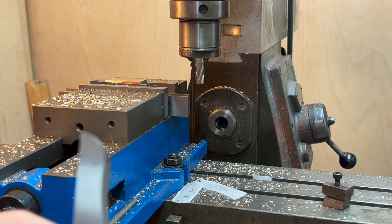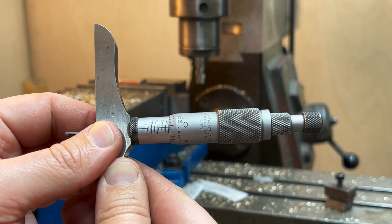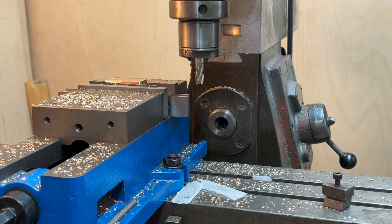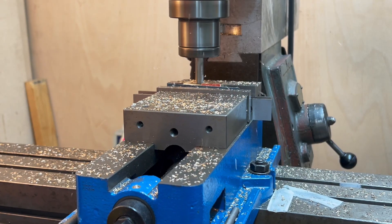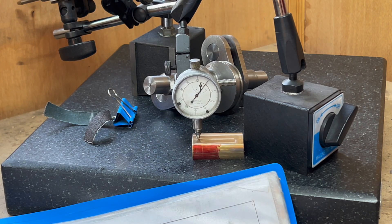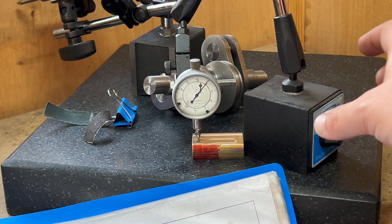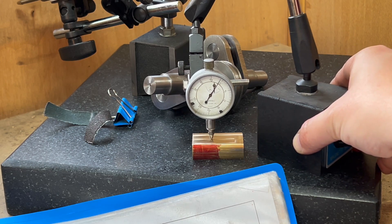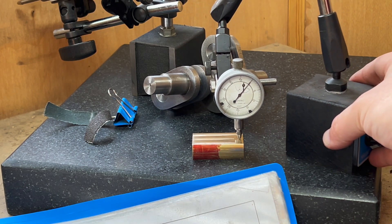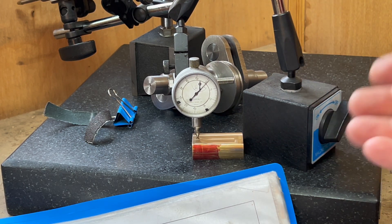If I use the depth micrometer — basically at 575. So 35 to come off. I was really a bit worried about the parallelism of the sides of this piece because it twisted in the vice that time. I thought I straightened it out okay, and we can check here — I've got it resting on the surface plate and the dial indicator on top. If we sweep across, we can see that it's basically flat, which is what you'd hope, but best to be sure.